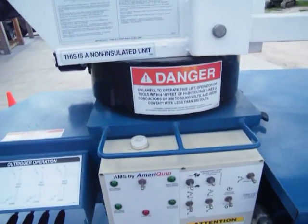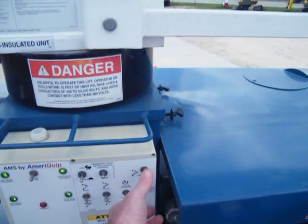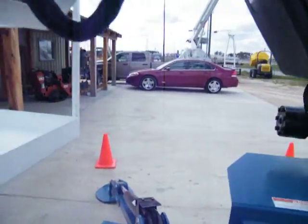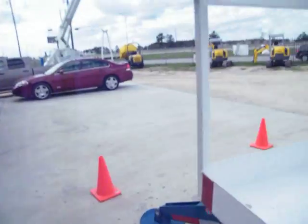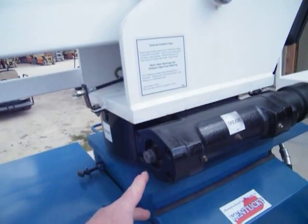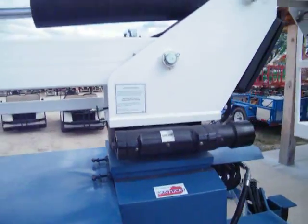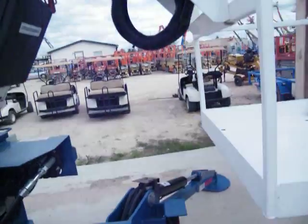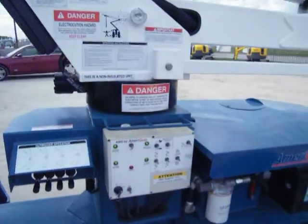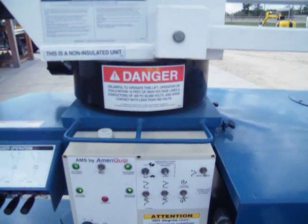In the event of the machine running out of gas, the E40H has an emergency power switch that can be used to bring your boom down. In the event that you are over the top of a roof, pipes, or buildings, a wrench can be inserted and used to rotate the machine very slowly by hand, moving the boom away from the structure and then lowering it down. The emergency lowering switch is located in the basket and in the lower controls. Remember: safety first.